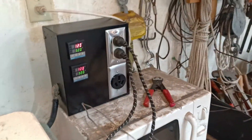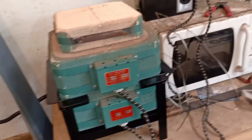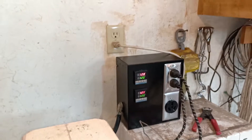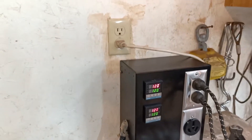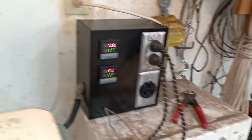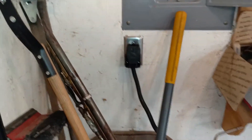The little kiln just has a pair of 110 plugs — 110 each, and they draw 12 amps each. So running both of them off a standard outlet is a little bit of an overload. So I set this up to run on 220, using this 220 outlet here, which is my welder outlet.